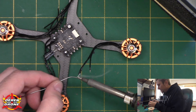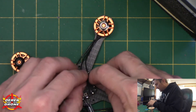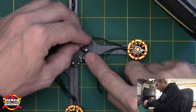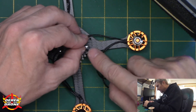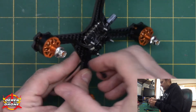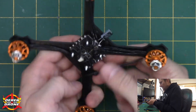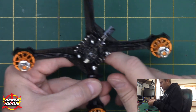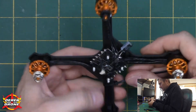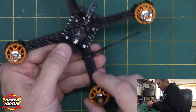Make sure that you retin your motor leads. When I solder them on, I'm simply going to swing them around and line them up with the pad in order — this should allow for a neat and clean install. This is all looking pretty good. I'm going to grab a zip tie from the kit and use it to secure my front motor wires. I'm not going to use it for the rear motor wires just yet — I have something planned for that. For now I'm just going to secure the fronts, and we're going to leave the backs how they are.